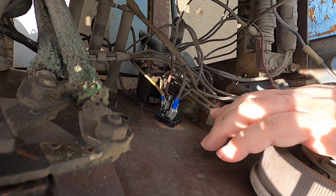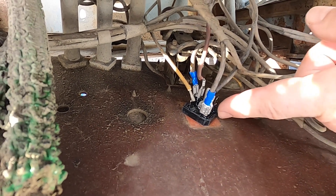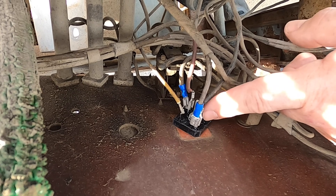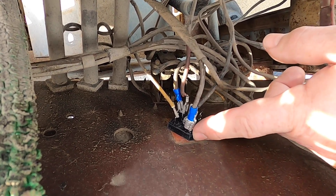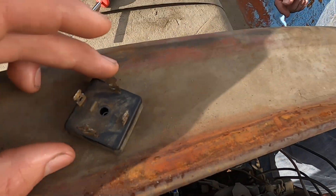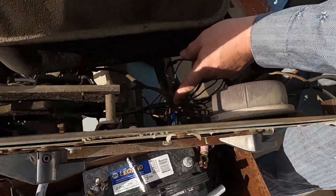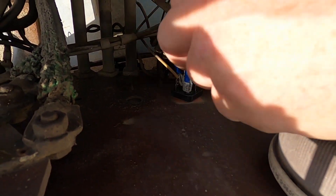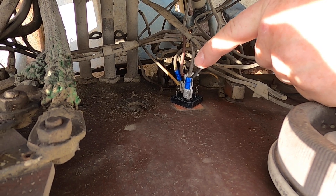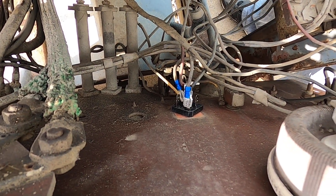We're just starting to put in the new one — I haven't hooked up the last two wires yet. These two wires are for the AC input. The positive is the one marked positive or has a slightly different terminal or clip on the corner. The old one was positioned differently, but the terminal that was up on it was marked positive. Something to note: the one on top marked positive, coming out of the windings inside the welder, feeds to a black wire. The one going to the negative output of the diode is the red wire — so this is backwards from what you'd normally expect, but it matches the factory Lincoln wiring diagrams.